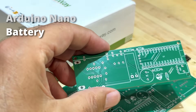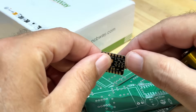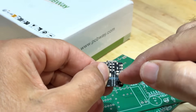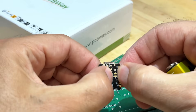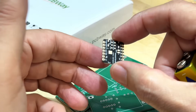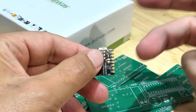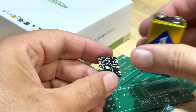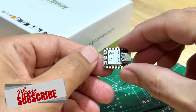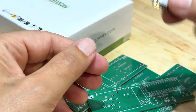The other issue was the battery. I'm using a nine volt battery, but this new chip has a feature some of the other small XIAO boards don't have - it has a battery management and charger system incorporated. You connect a 3.7 volt battery to those two points, and when you have your USB-C connected, it charges the battery. It's a very slow charge - probably 50 milliamps - so it takes a long time, but you don't really need a very powerful battery.